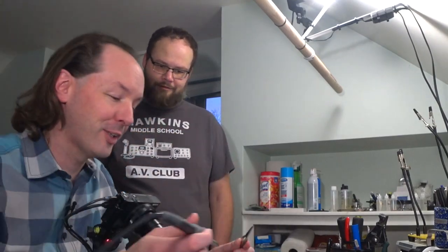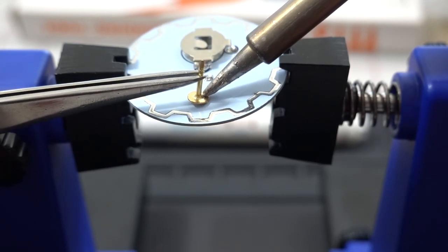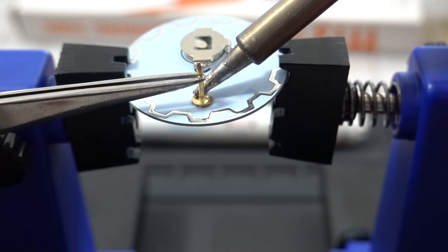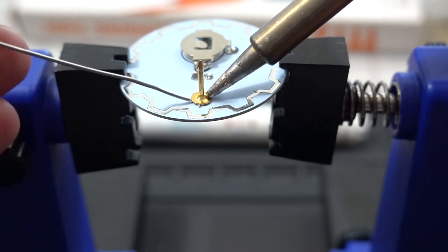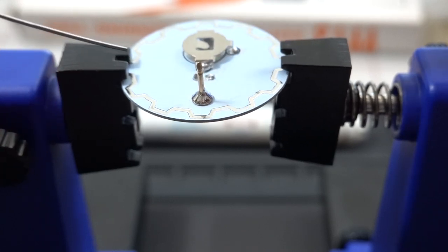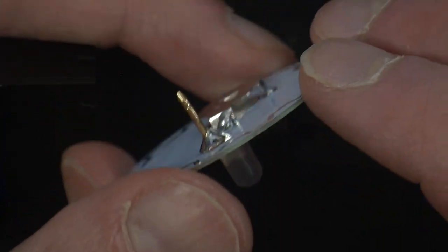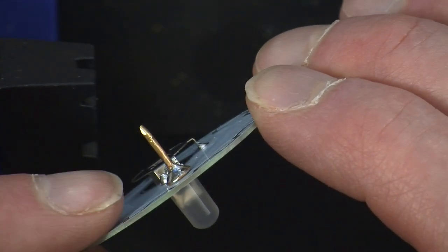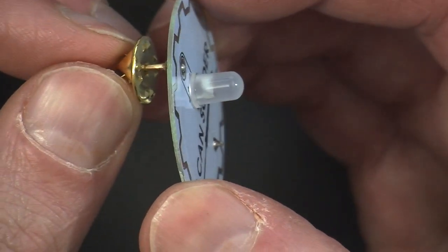How about if I hold this with the tweezers and try to do it? Oh yeah, there you go. I learned from your comment — I don't want you yelling at your screen. This is surprisingly hard to do because everything's articulated. The nice thing about big stuff like this is you can add solder and then move it around afterward. I gotta get solder under the thing. You got it under there, you're good. Allegedly. Proper fillet technique up here on the giant one — bonus points for that! We'll test it — and that passes the tug test.